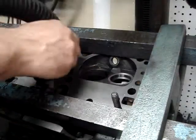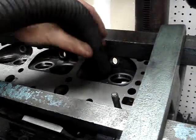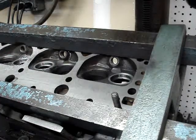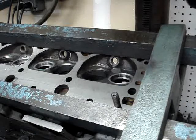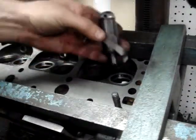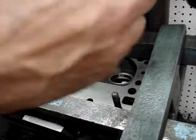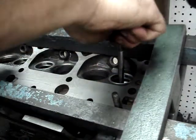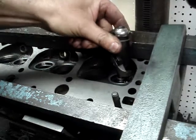So the next thing is we want to get all these chips and stuff out of here. We'll go ahead and vacuum all this up real good. We have to put our pilot in there — we sure don't want any chips getting in there between the pilot and the guide. So we have a cutter here. This cutter is one inch, six hundred thousandths. We'll put our pilot back in there, put a little spring on here to give us some resistance. And there's our cutting tool. You can see that cutter is going to go down and cut that.